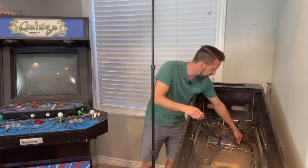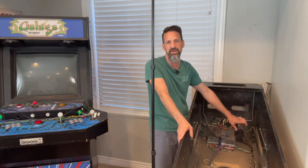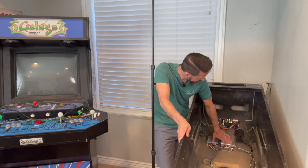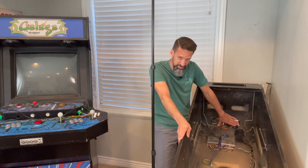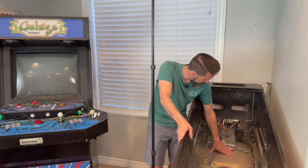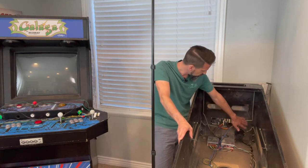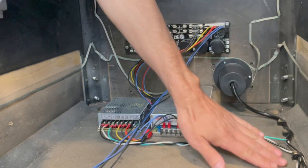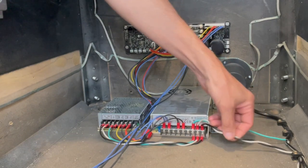Long term, once we get to the final build, I'm going to run a small diameter PVC conduit pipe through the cabinet to cover those wires. We've also got the power supplies and power boards back here along with our first nano controller board — these are pretty far back in the cabinet. We're still going to have a little protector come down over the top of them to make sure no screws or washers fall down and short anything out. We'll also make sure it's properly ventilated.